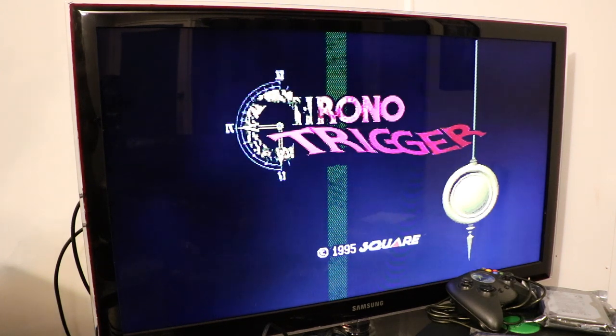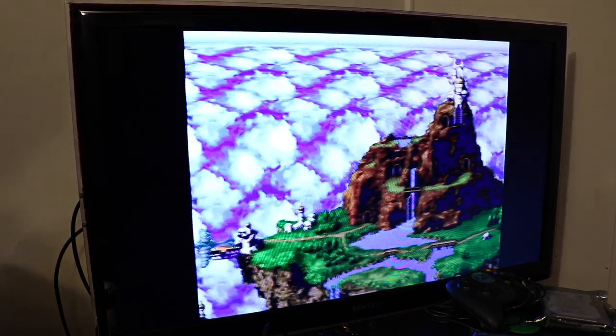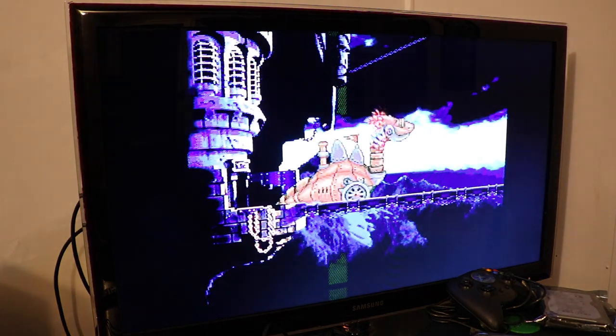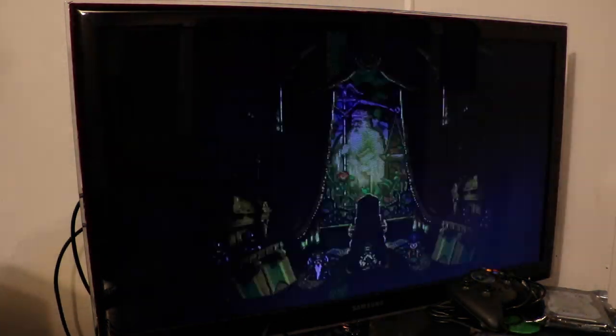This unit was purchased brand new. No, that's not true. It's quite old. It's 20 odd years old. It was purchased from Japan in working condition. Unfortunately, the game that they decided to throw in for free shows a fault, which is unfortunate. Not a good game to bundle if it shows off the faults with the console.